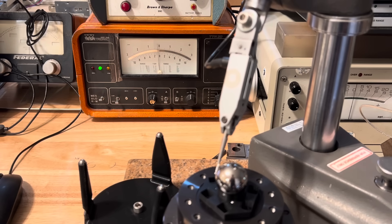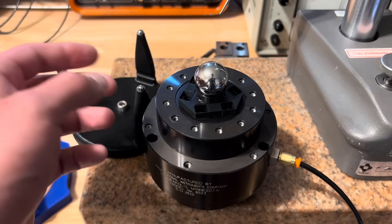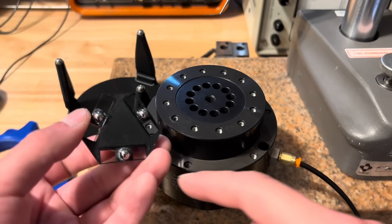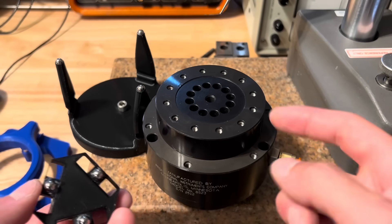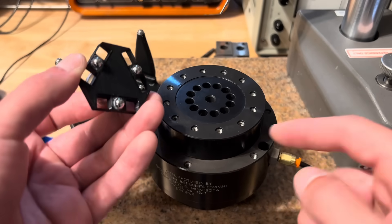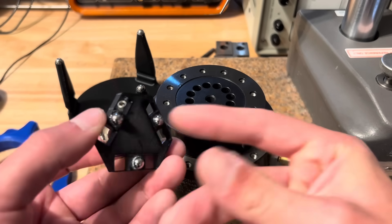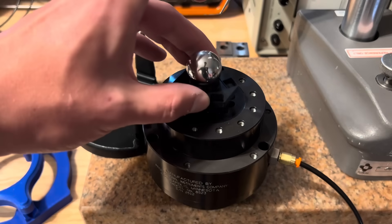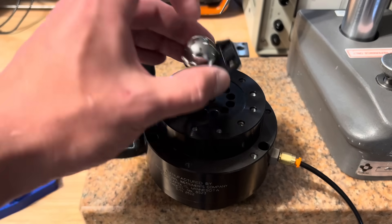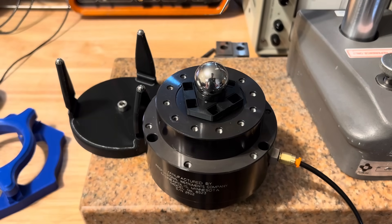It doesn't really need to be much more than that. Some of the lack of repeatability might be due to the fact that the kinematic interface isn't ideal between the balls and the holes — this is a hole after all, it might not be perfectly round, and we don't know where it's contacting; it's a little bit over-constrained in that regard. In the ideal sense, like in a Kelvin clamp or Kelvin coupling, you'd have a trihedral interface where each ball contacts on three points. But this isn't exactly as ideal as that, and it's good enough for what I'm doing here. I just really like the concept, so I thought I'd share it. Hope someone finds that interesting — thanks for watching.